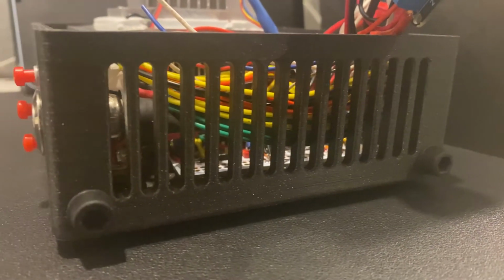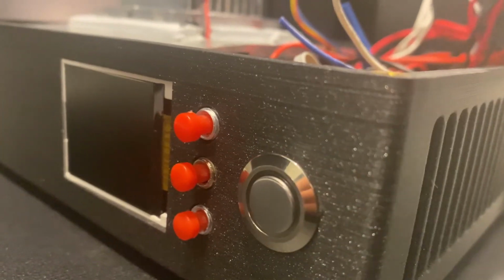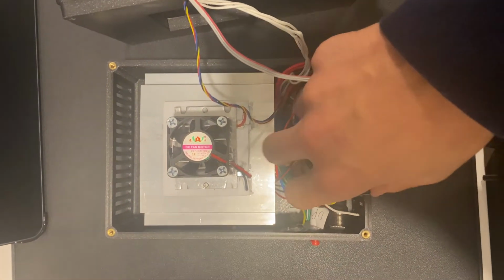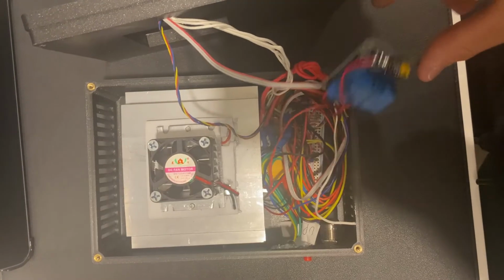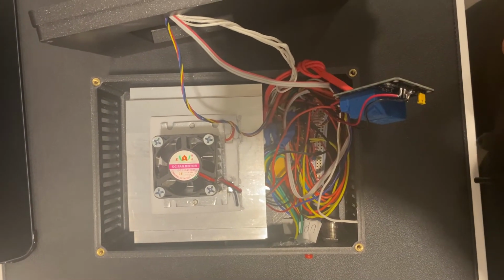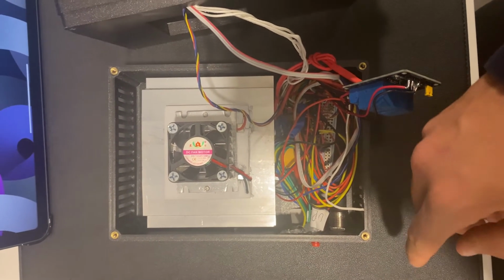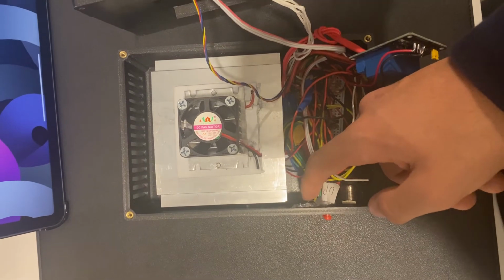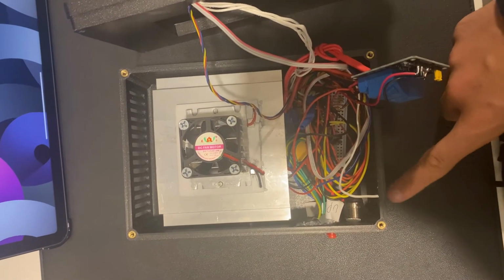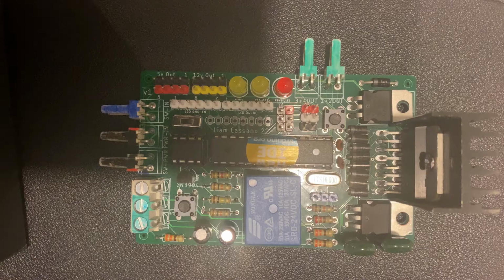Lots of the design changes included small details such as the vent holes at the bottom and the placement of buttons. A top-down view of the electronics shows a relay module, a perma-proto board hidden underneath there that has a 328P, a 555 timer latch circuit for this rugged metal button, the connections for the display over here, and the 3 buttons over here. Then there's also DC power coming through the bottom with 12 volts, 3 amps.